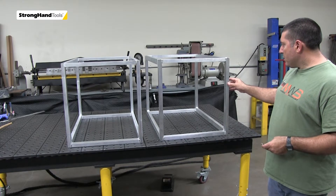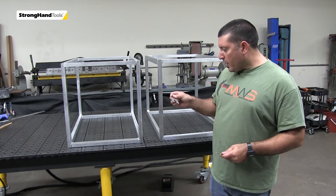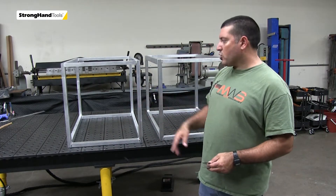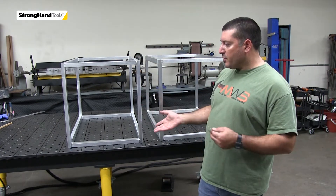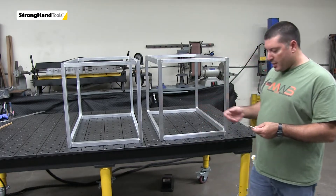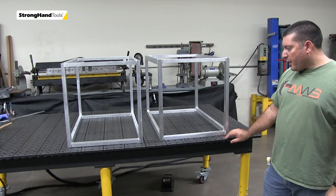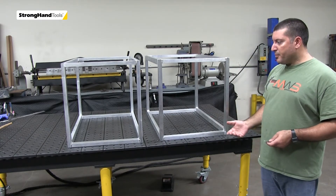So I have a couple of basic shims here I wanted to show you guys without getting too detailed. This is a 75 thou shim — this corner, I can get that under — so that's quite a bit, and that's just across from corner to corner. And this one is a 25 thou, and again corner to corner it's a little less than 25 because I'm pushing the 25 underneath this corner. Both of them we ground the welds off the bottom the best we can to try to get it pretty flush.